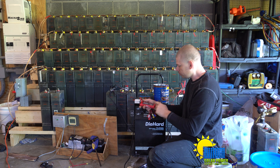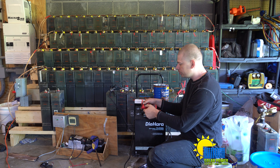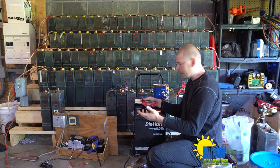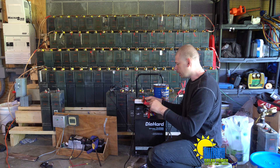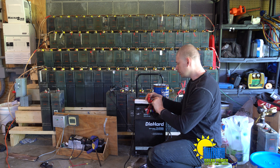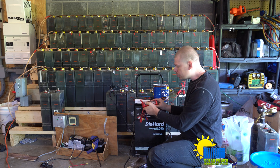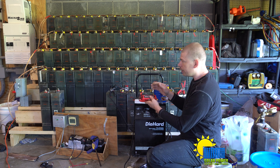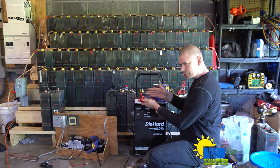If I add those cells I can directly increase the capacity. The capacity I'm looking for is 5.3 amp hours, and this pack can discharge at 70 times its rated charge rate. The charge rate is 1C, so that's 5.3 amps — you would never want to charge more than 5.3 amps into it. You'd have to put some type of resistor in there and have your inverter shut off at 45 volts.